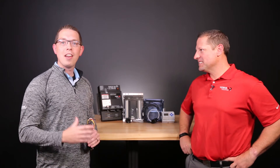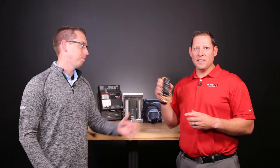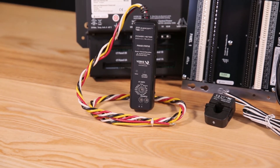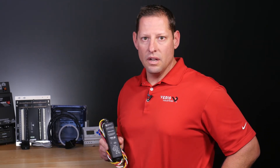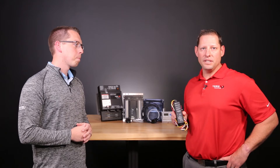Another product known for its versatility is the E23, also known as the next generation Intercept. We consider this the evolution of an industry standard. It has the capability to work in a variety of situations, which makes this product especially well suited for retrofit use. It is compatible with current transducers or CTs from 5 to 5000 amps, allowing installers to often use existing one-third volt CTs with the new meter. Another element that makes this model retrofit-ready is its wide input range, 90 to 480 volts, so one model works with various setups. It offers Modbus and BACnet outputs and both uni- and bi-directional feature sets. It is also very small and does not need external mounting, so it can be installed easily in existing panels with limited space and reduced installation costs of running conduit to an external enclosure.